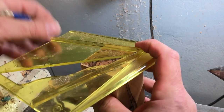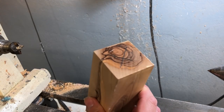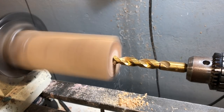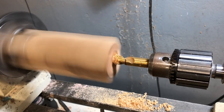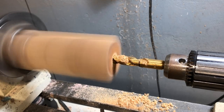The first thing you need, aside from the hammerhead kit, is a wood blank of your choice measuring one and a half to two inches square and at least five inches long. Mark the center of the blank on each end and drill a half inch hole about two and a half to two and three quarter inches deep in one end. You can do this at a drill press or the lathe with a scroll chuck and a bit in the Jacob's chuck in the tailstock.